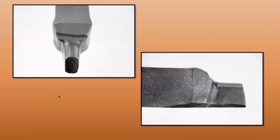Note that the bottom of the jaw is still proud of the nose at this stage because we've not cut for the jaw or set in the teeth or the tongue. So make that proud of the nose at this stage. Note that the cheeks are sloping back towards the lower jawline from the top of the snout. We've got a nice strong brow and we've got plenty of upset material here to make the ruff and the bear's ears. I'm going to leave that sitting there just for a moment while you have a look at that.